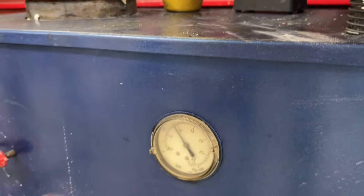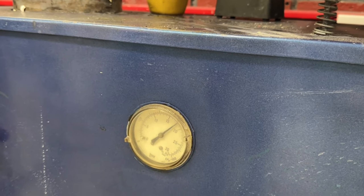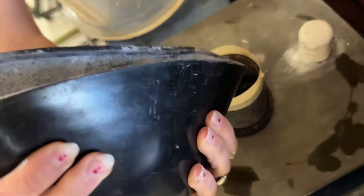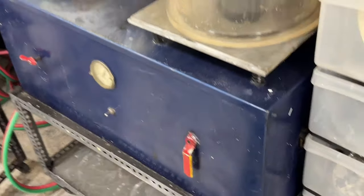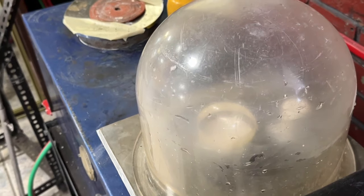Once it's decently mixed, turn on your mixer and mix it all together using a cake batter mixer. With this investment, you have about five minutes of working time. I like to mix for a minute inside the bowl, put it in a vacuum for a minute, make sure all the air bubbles are rising to the top by knocking on the metal plate. You're doing this for a minute — no matter what number it gets to, once a minute is up, take it out and pour it into your flask. When it's time to pour into your flask, don't pour directly on your piece — pour it off to the side, sometimes tilting the flask. Don't fill all the way to the edge because it can boil over. Then let it go again for another minute underneath the vacuum — you're now up to three minutes of working time. Try to use about three and a half to four minutes total.